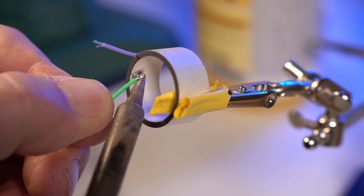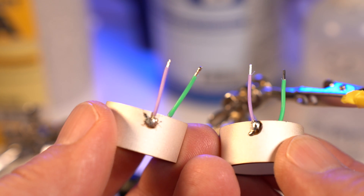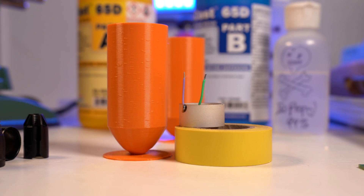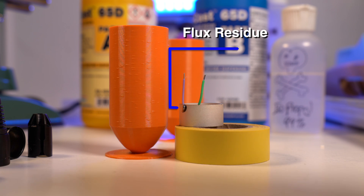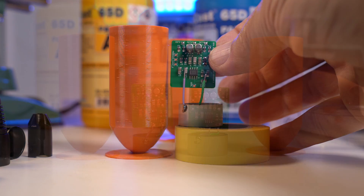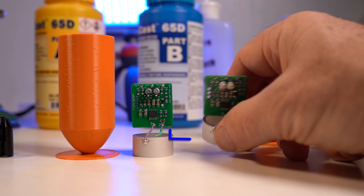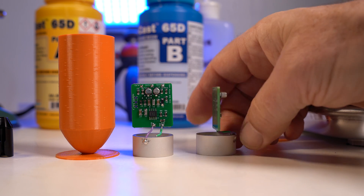Here are both of them prior to cleaning. I designed a single-use mold for this and then 3D printed a pair of them - all the files are in the instructable. We need to make the element and the printed circuit board all fit inside so that it is totally encased within the resin. Here are the completed assemblies ready for the mic cable to get attached.